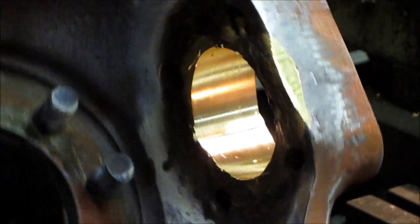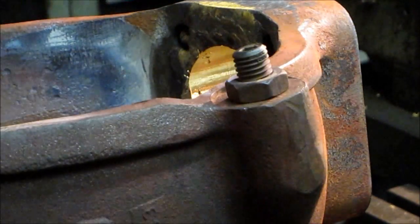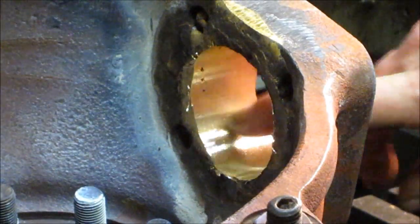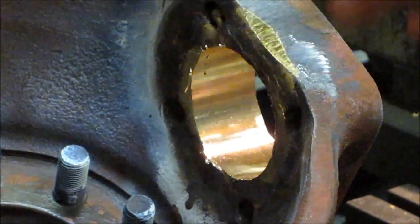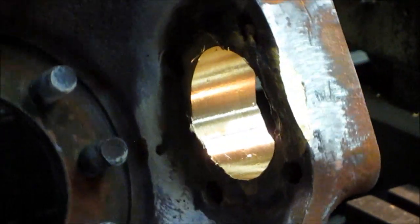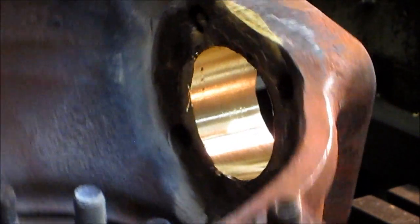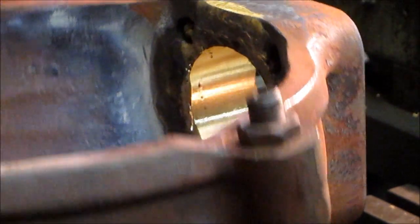This is what it looks like on the inside — of course you can't roll it all the way around. There are a couple little tiny holidays right in there. We've got to kiss this flat on this face here, take off the height over here, take one more skim on the bore, then work both ends, and come back to do the finish size after we're all square on both faces.